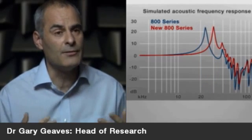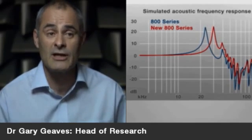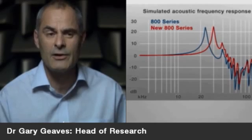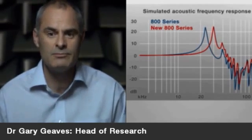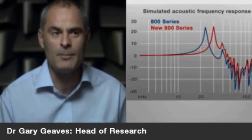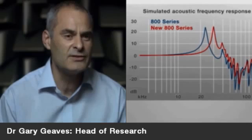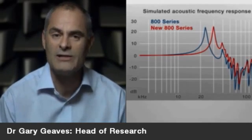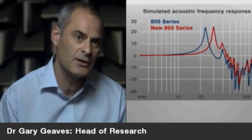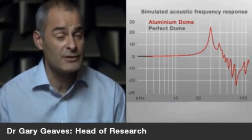We found that with each improvement in breakup frequency, the resulting tweeter sounded much cleaner. Now, we found this really curious because, as I already said, you can only really hear up to 20 kilohertz. What difference does it make if you improve a breakup frequency from 23 to 30 kilohertz? So we started to wonder why this was, and really about ways that we could improve the breakup frequency much further.